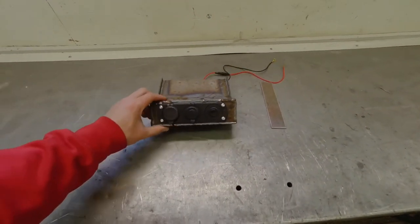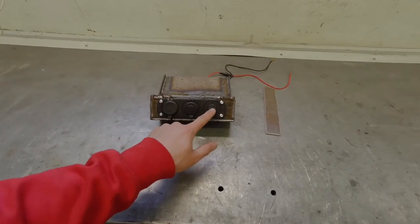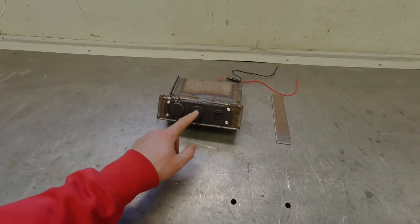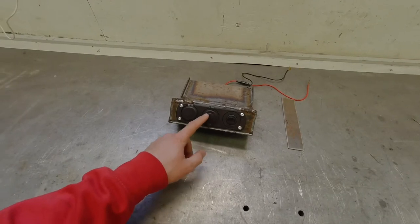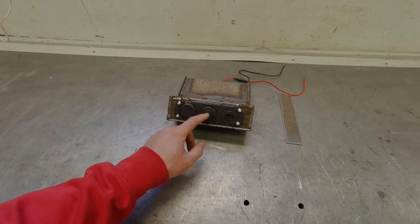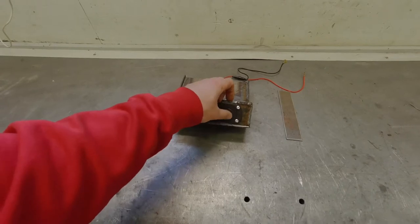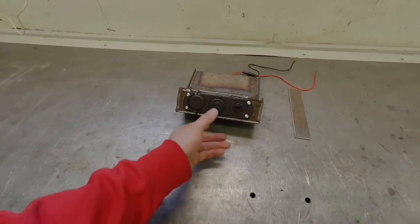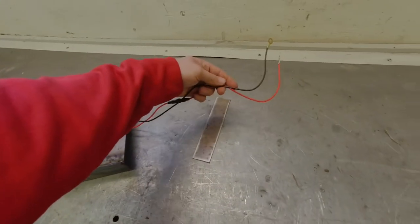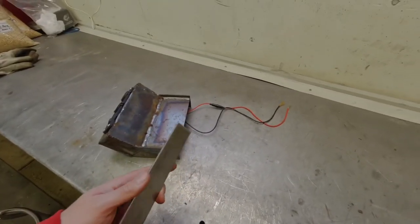So I designed this unit here. You've got that Amazon faceplate that fills in here, with your on/off switch so you don't drain your battery dead in case you've got your phone or a GPS plugged in overnight — a lot of those Trimble units like the 250 models don't have power switches. So you'll have an on/off switch if you're using the cigarette lighter for that. You've got your easy hookup, two wires, red and black. When I redid the cab in that tractor I already ran the power wire to it, so that's going to be easy and simple.